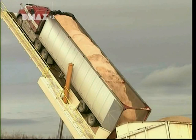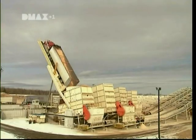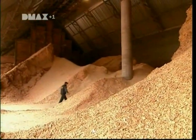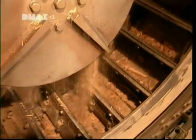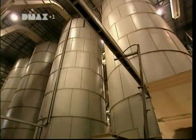Timber mill leftovers provide the raw material for chipboard. The process starts with truckloads of sawdust. The next ingredients are wood shavings and wood chips. The chips and shavings are fed into a large mill that works like a giant food processor, chopping them up into little bits. When the milling's done, the particles are less than 0.7 millimeters thick.